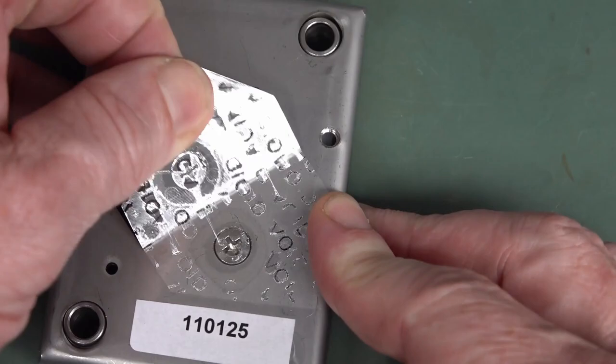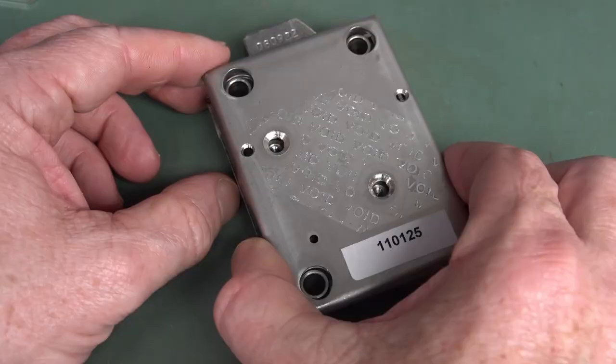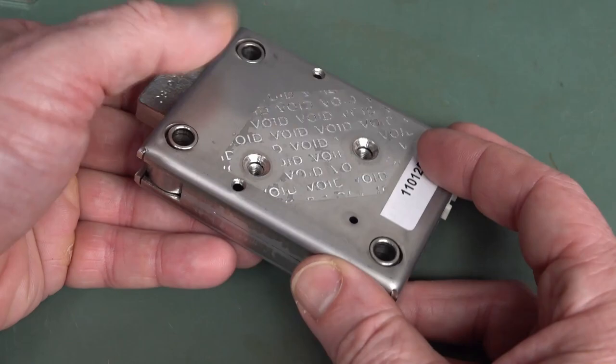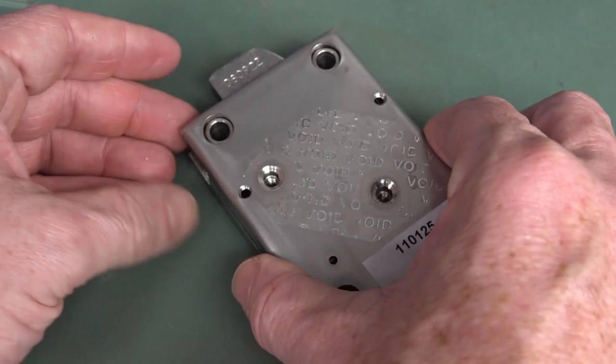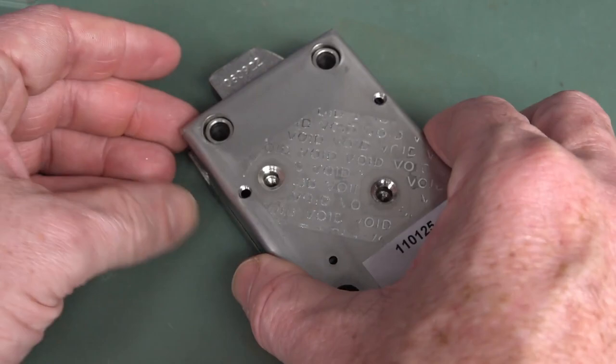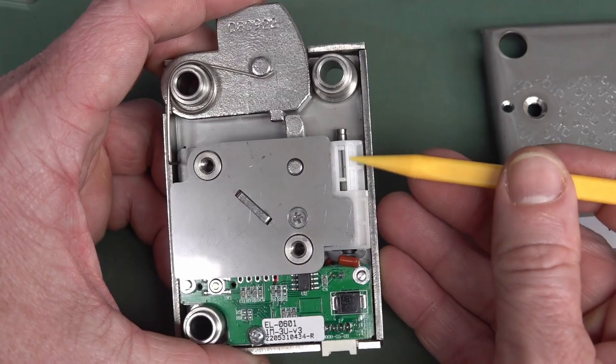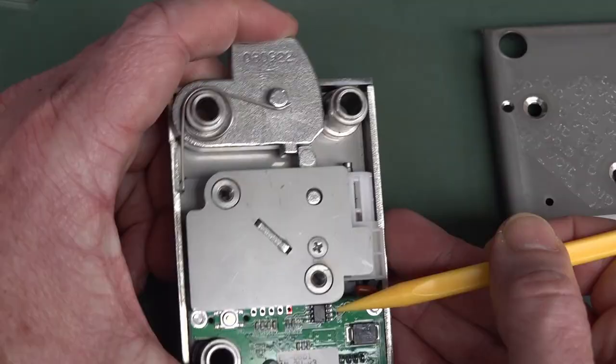We may have to void the warranty - yep, void void void void. We're in - there's the swing block mechanism. And you can see - oh, it's not a solenoid, it's a motor drive. This will not be susceptible to a magnet attack or a magnetic attack to activate a solenoid - you've actually got to drive the motor and the worm drive has to swing the bolt back. Apparently this thing has like 10 times the strength required by the Australian standard.